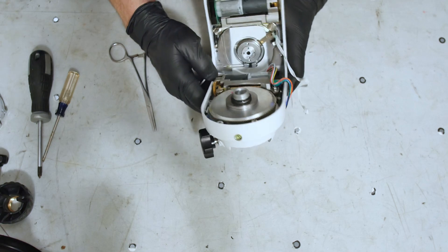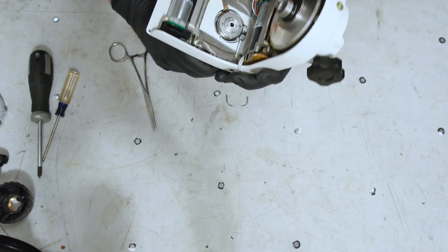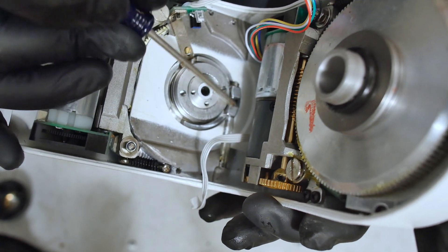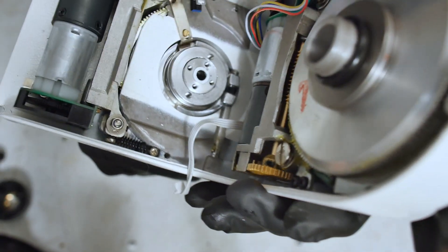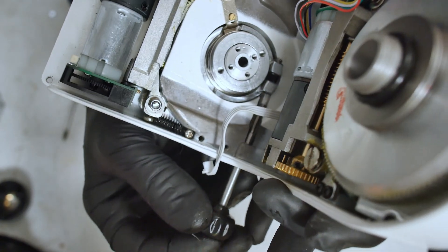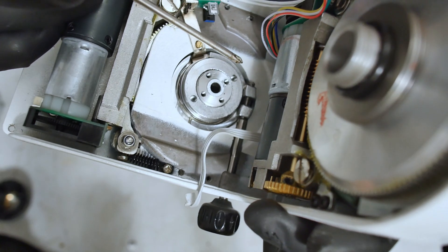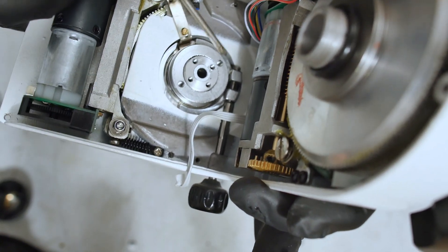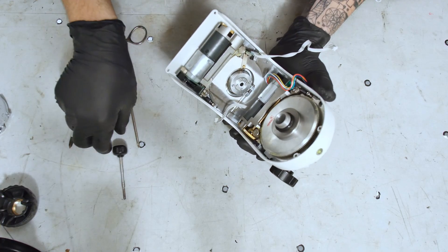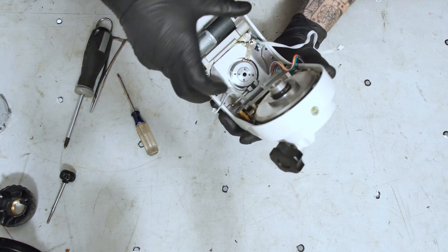I can see the clamping ring and I'm pretty sure I can see the problem. This here is the clamp that locks the azimuth axis. That screw goes in the side here — you'll see the screw come in there. It should thread into this side here, but it's not. It looks like there was a threaded insert or something that's been pressed out. So we can see the problem — it looks like there's a helicoil insert that got pressed out somehow.